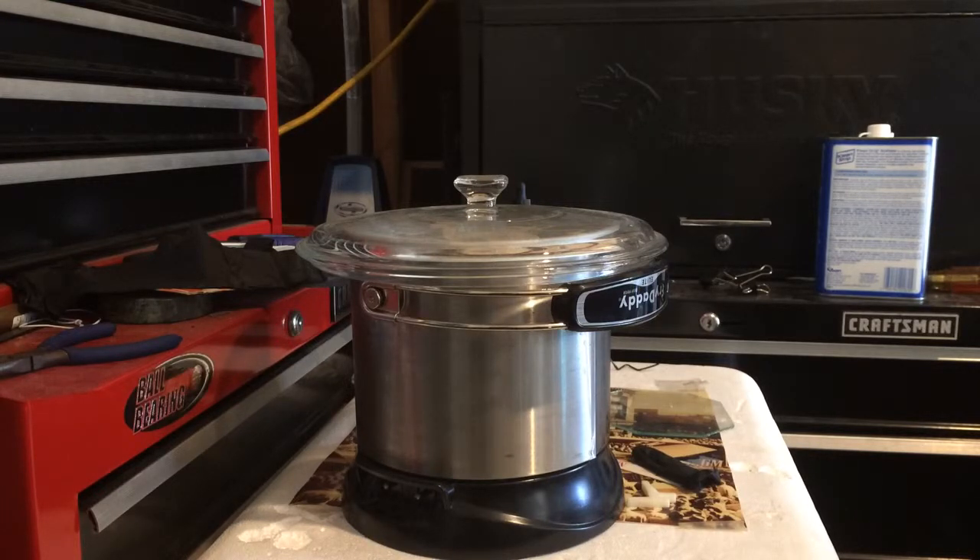Each model you do may be slightly different and you have to gauge it. You'll know after the first couple of times you do your first few acetone washes. Do it on parts that you don't care about — do some testing — see how it affects the plastic so you can get a feel for it. You can gauge how long you need based on the layer height you printed at and the complexity or small parts or fine tips of the model.